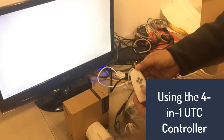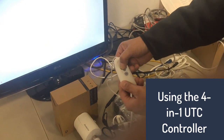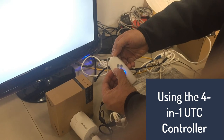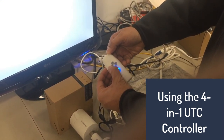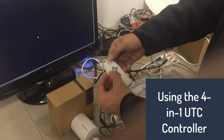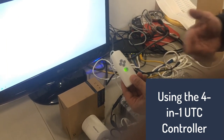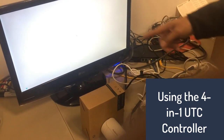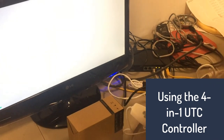If I wanted to change it to TVI, I press this — I want to get a green LED on the left. I'm going to press and hold TVI. Now the green LED lit up, telling me it's switched to a different signal type on the left-hand side. This is going to be TVI. Watch my DVR — it says TVI now. That's pretty much how you use this UTC controller. Thanks for watching.